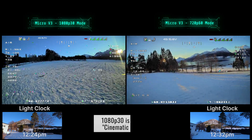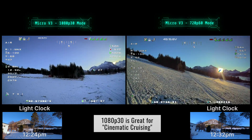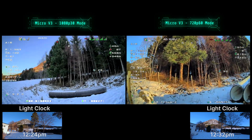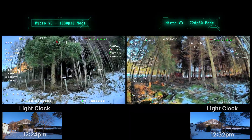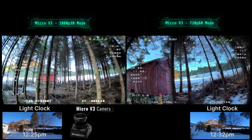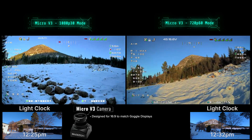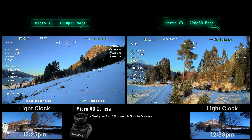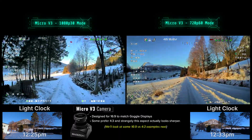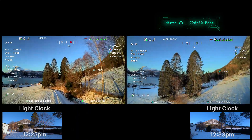But if you're doing a cinematic type of stuff and you want to use HD Zero, which honestly I think works great, I'd recommend the 1080p 30 mode. It just looks really nice. The 1080p mode, you just get a little extra detail, which is nice. Now here's what I'll say about this camera specifically and this setup: it is set up for 16x9, because HD Zero's goggles are 16x9 and so you get to use the full goggle display when you run it in 16x9. Now I know a lot of people like 4x3, especially if you're racing, so you get a little extra vertical view — and we can take a look at that. But 16x9 is definitely optimized for the HD Zero goggles. That's why they went with this camera configuration.